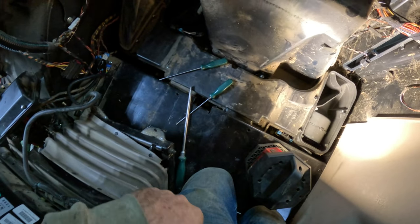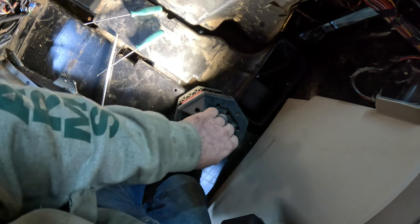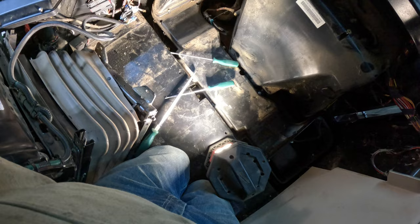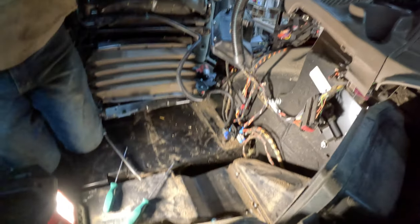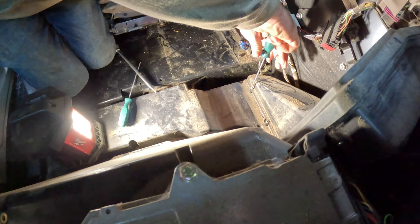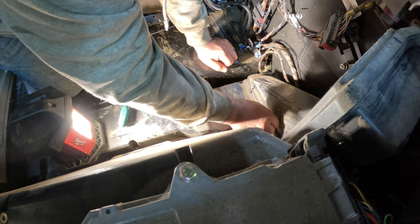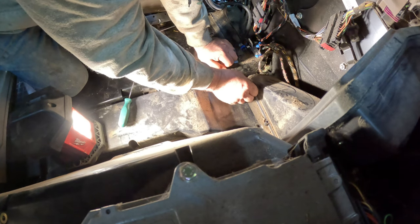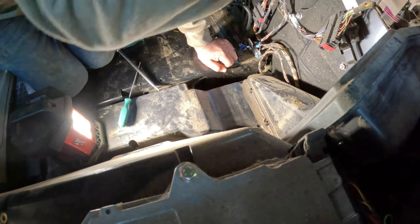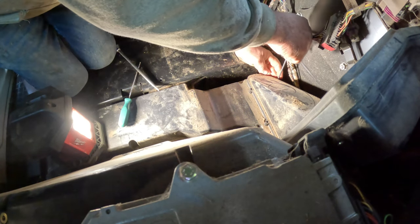Only this just gives me a bad attitude, not bad breath. We're gonna do the other side, and as I'm looking at this I'm pretty sure I'm gonna have to take the plate off that I'm sitting on. He did tell me I was gonna have to move the seat, so that would only make sense that I have to move that plate. I didn't take nearly enough screws out yet from what I understood. We're gonna take this side out — a power screwdriver would be nice, but sometimes you just gotta go old-fashioned. There are three or four screws and then there are little clips, so don't get frustrated and try to take it off after the screws are out or else you'll break it.